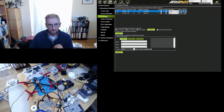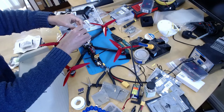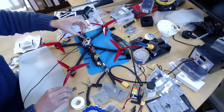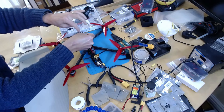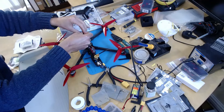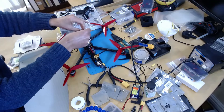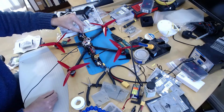The next thing I need to do is orient this correctly. Where I want to put this is on the side of the frame. Looking at the board closely, there's an XYZ orientation marking - the front is here and this is down. So what I want to do is pitch down by 90, which I believe is 270 pitch, and roll left by 90, which should be roll 270. I'll also try enabling auto rotation during calibration to verify.